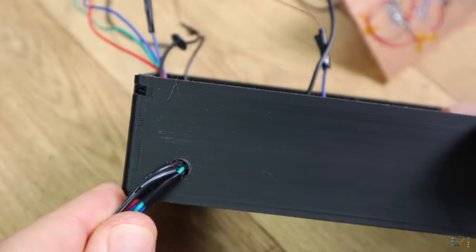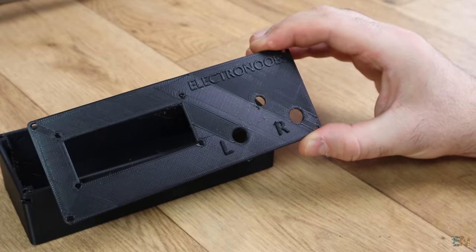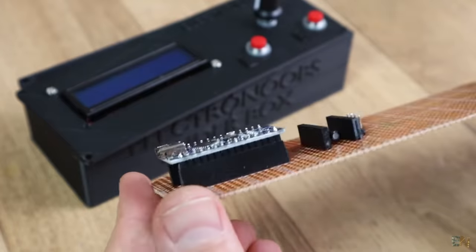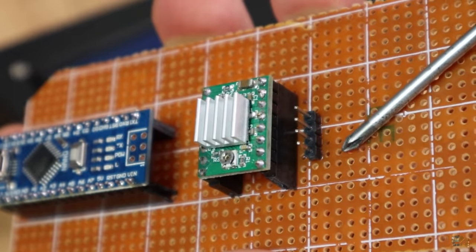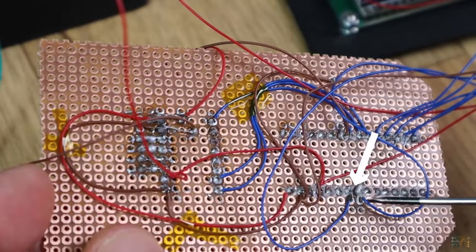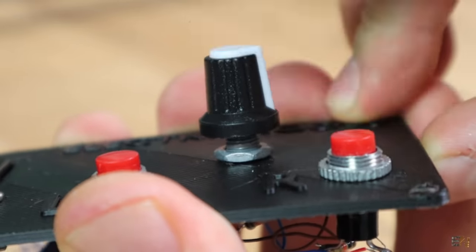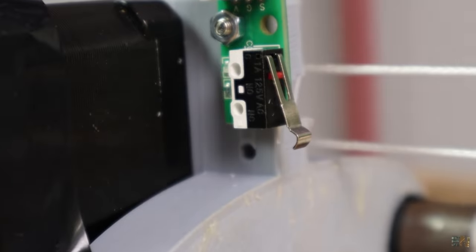The wires from the motor and the switch will go inside of the control case. Download and follow the schematic of this project from the link below. I first screw in place the LCD, the two push buttons and the rotary encoder in the middle. On a drilled PCB and using female pins, I solder the Arduino Nano and the step motor driver together with a 10uF capacitor for the 12V input. I also solder 4 male pins for the driver outputs for the step motor connector. Using wires I connect the I2C pins of the LCD to pins A4 and A5 of the Arduino. The end stop switch is connected to digital pin 4.